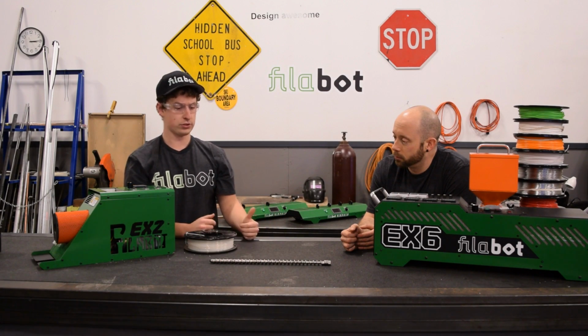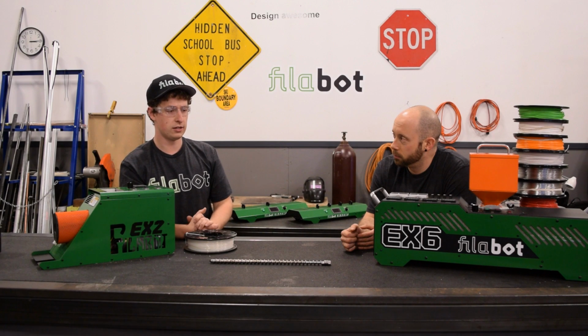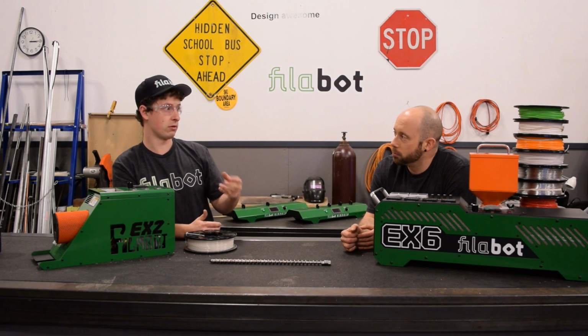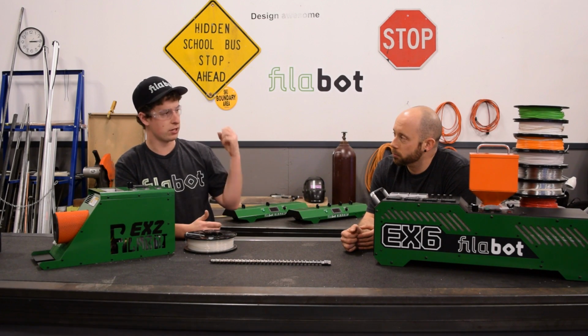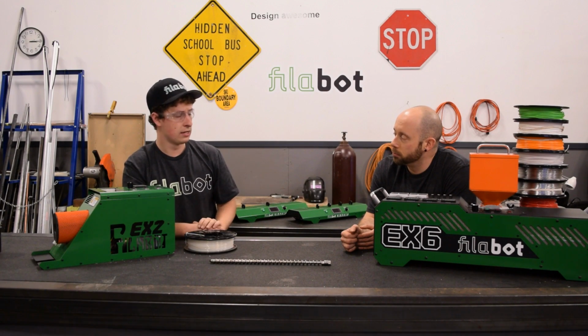But we're looking at different screws with higher compression. So this would be for polymers that have higher melt flow. Yes, plastics that run more when they melt. You have to have that higher compression to work with them. Some TPUs and TPEs will be playing with that.